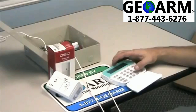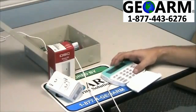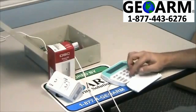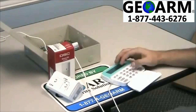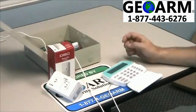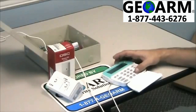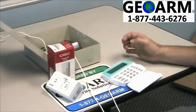Next, go into field 101. After you're in field 101, you want to press 8 to enable wireless sensors, followed by pound. That will enable the wireless sensors.